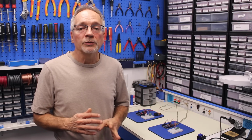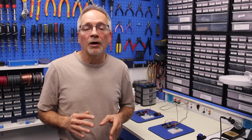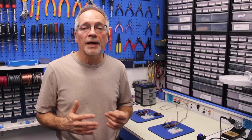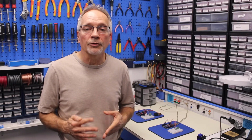Now the last demonstration we did showed how you use the DHT22 sensor and sent both temperature and humidity data by combining them onto a comma delimited string. And you can extend this technique for other sensors. You can send more than 2 pieces of data at a time, and you could also use the analog inputs on your Arduino. So let's say you wanted to get the input from a joystick. You could use the X and Y axis on the joystick to drive 2 of the analog inputs and send that data over the Arduino to a remote. So this could make a very simple remote controlled joystick arrangement if you wish. There's a lot of possibilities over here.